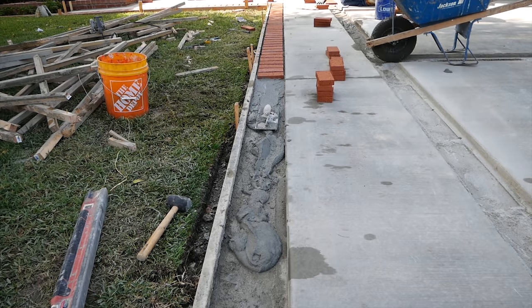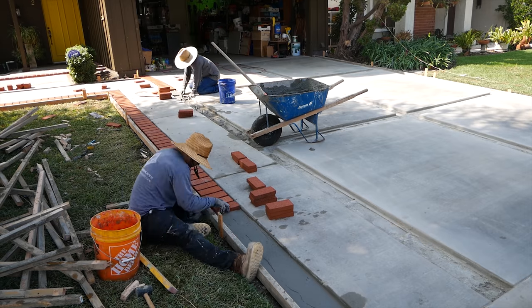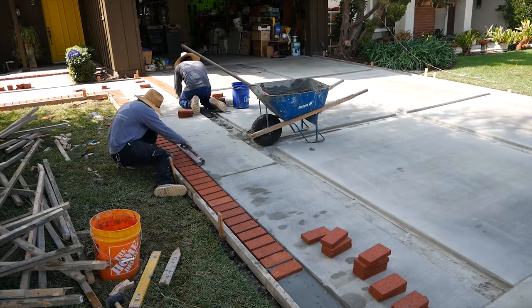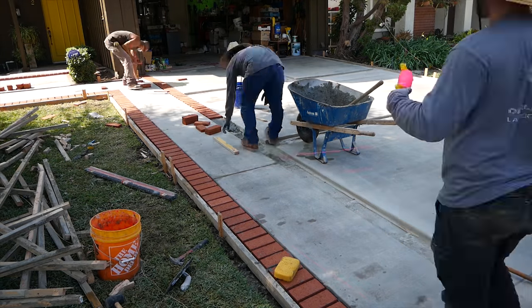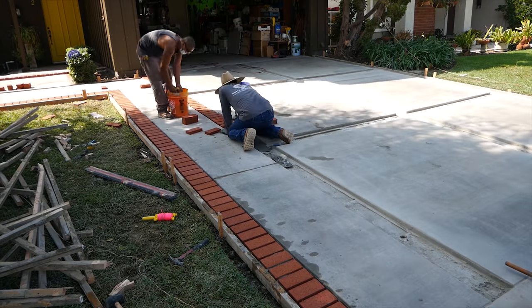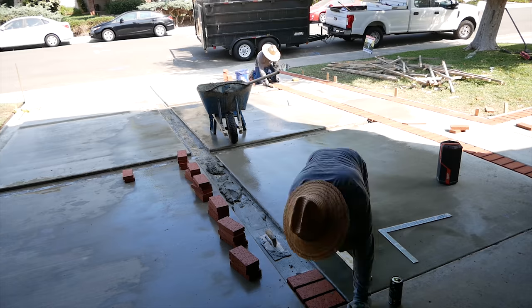The key to putting these inlays — especially because you have vehicle traffic — is that you don't want a lot of air pockets underneath the brick base. Wherever you have air pockets and you're skimping on your base, you can crack bricks driving over them. In this case you can see they're sinking in and pushing up some excess material around the perimeter, so at that point there are no voids. Brick has a lot lower strength than concrete, so the sooner you get the brick setting on a solid concrete base, the better you are.